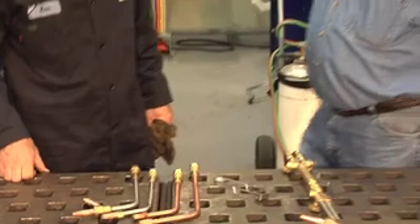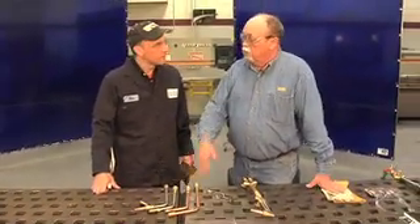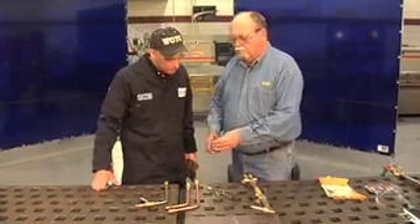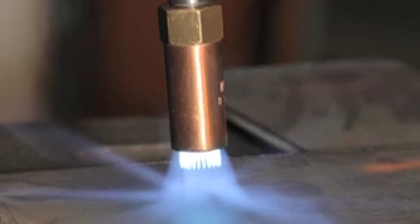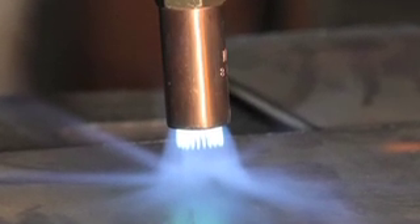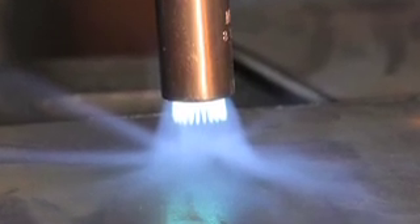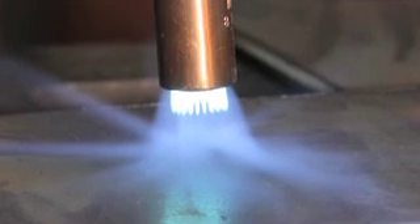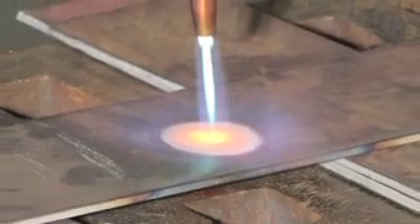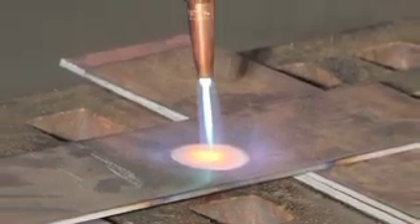Sure. There are several tips made for different fuel gases; the ones we're talking about here are alternate fuel gas tips. This is a standard number eight multi-flame tip, which you'd use for alternate fuel gas to heat up a piece of plate or angle iron you wanted to bend. Remember we talked about acetylene with pinpointed heat? This multi-flame tip gives you enveloping or saturating heat. If you want that pinpointed heat, we have a CHP — a concentrated heat tip. So there are many ways to do it.